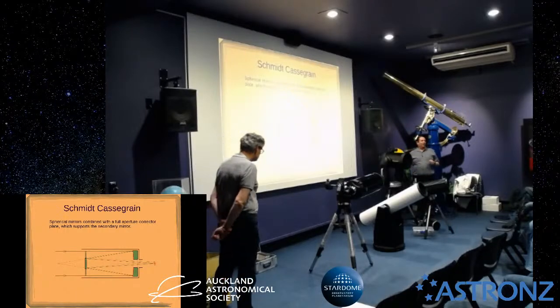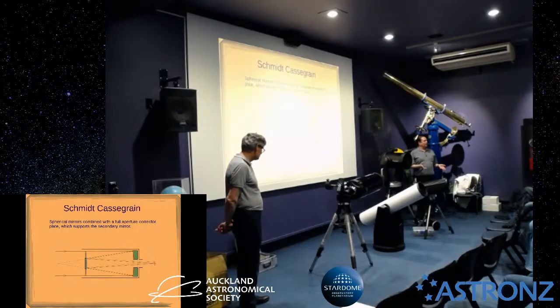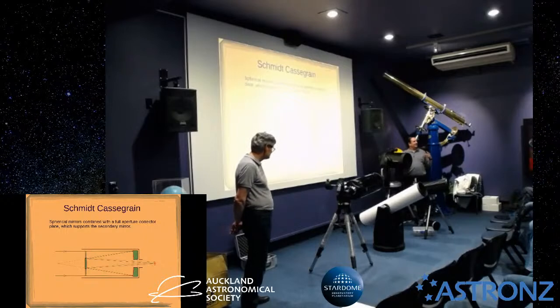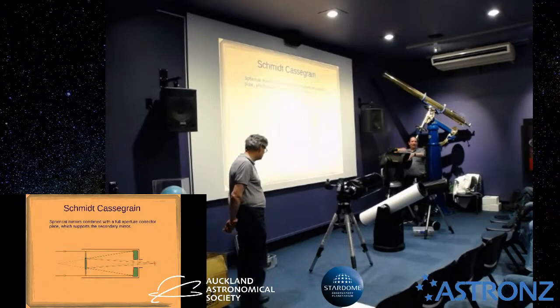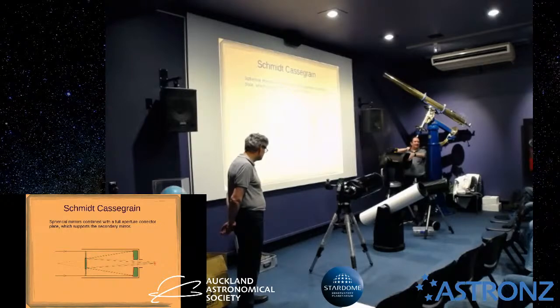And you do that with a camera or looking through the eyepiece. If you look online, there's a whole bunch of guides which are the usual way of doing this to work out which way you need to adjust it. If you're doing this visually by looking through it, put your hand over part of it, don't touch the corrector plate, of course, and see whether your hand is near the bit you need to move that central part towards or away from your hand, and then work out which screw is closest to that. So if I put my hand on that screw, and I realize that I've got to move it so it's close to my hand, then I'll be adjusting this screw. If I've got to move it that way, then I'll think, oh, well, it's probably that screw I need to adjust. Again, it's the same thing.